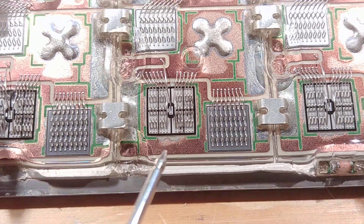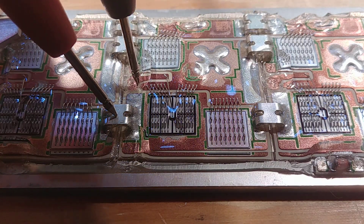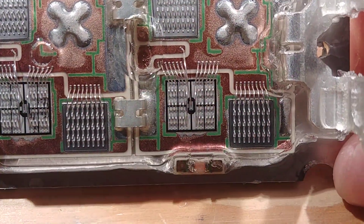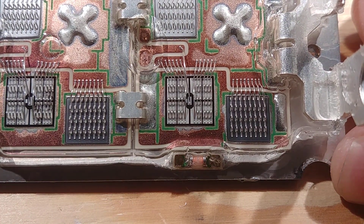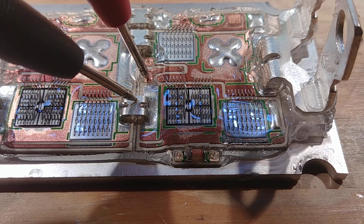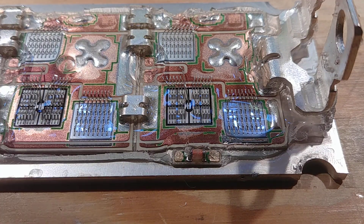You can see the gate drive. If I check to that one, you'll see it's shorted. But if we look at the last IGBT here, this one looks okay — there's no discoloration, everything looks nice, it looks completely intact. And if we check its gate the same way, you can see it's not shorted at all. So it's good.